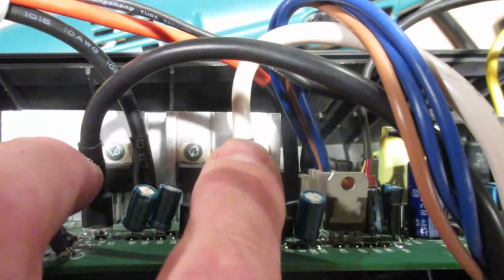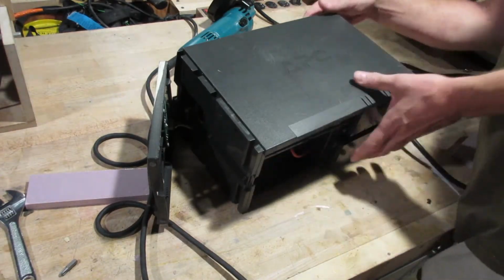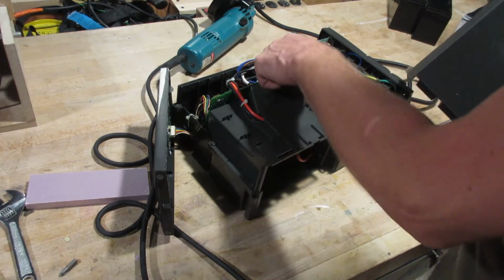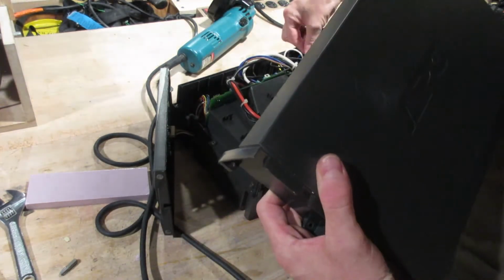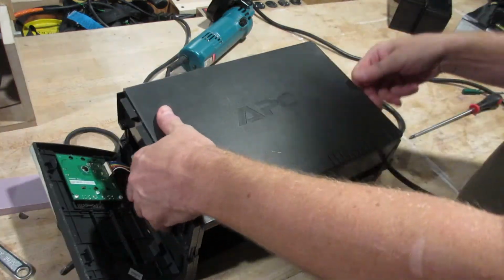Oops, I almost missed a couple of connectors here. There's two, like, right behind the big heat sinks. And there's a white and a black, and they go to the transformer. So don't forget about those. And yes, that other connector did go in there. So we're all good. There's little notches here in the PCB so that the wires cannot impact the case, which is great, except it's a little hard to get them all lined up. What's in the way?